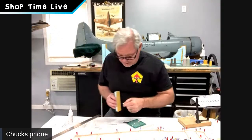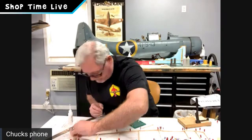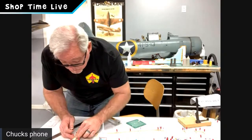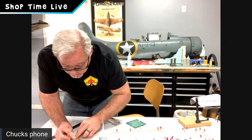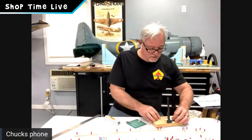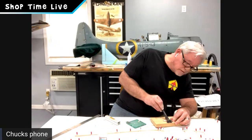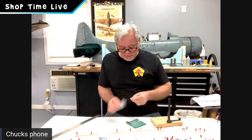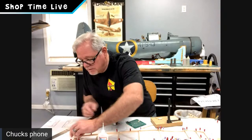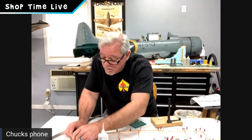One of the things that I wanted to point out too, so that people don't get confused, is on the die diagram in the front of the manual where it shows the dies. I'm looking at the number. I think it's 84, but I want to make sure. For your lamination sheets, it's die number 84. Those are actually labeled backwards on the diagram. So your FB1 and your WS1 are swapped. The top piece on there should be the FB1. The next piece with the notches should be the WS1. I just don't want anybody to get confused on it when they go to build that.